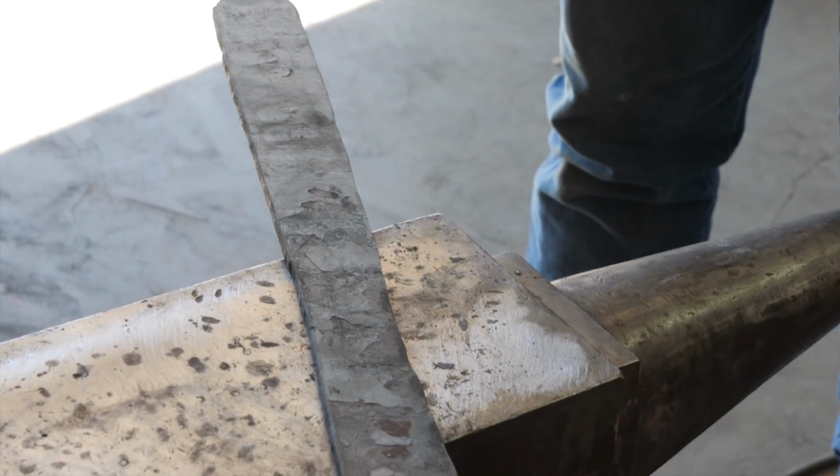Pretty quick, about 2.5, 3 hours for Damascus. That's how I do a 92 layer twist Damascus pattern and get a nice little 25-inch long billet out of it that's about 1/4 inch thick and 2 inches wide. Well, Kyle, thanks for having me over, because I've read a lot of books, but I saved a lot of time today. Yeah, I'm really looking forward to seeing you forge up yours next. Well, I am too. I hope I'm man enough to twist it.